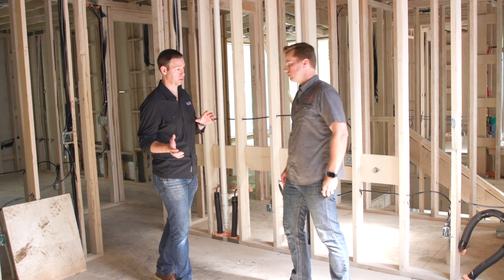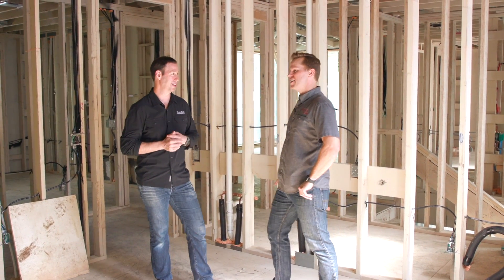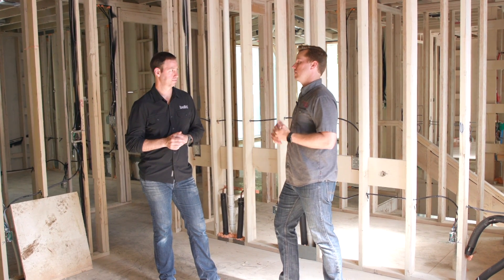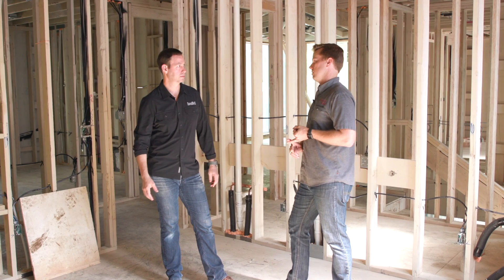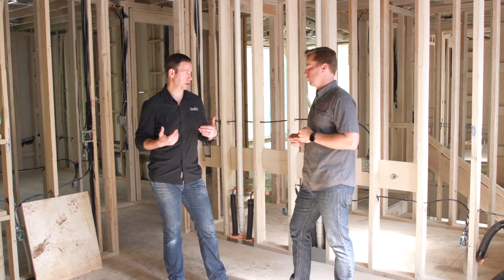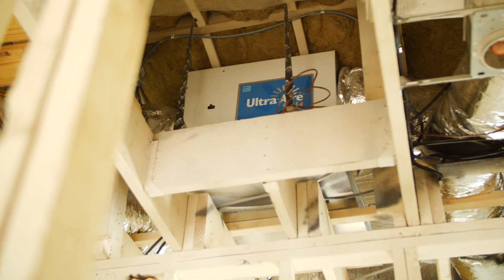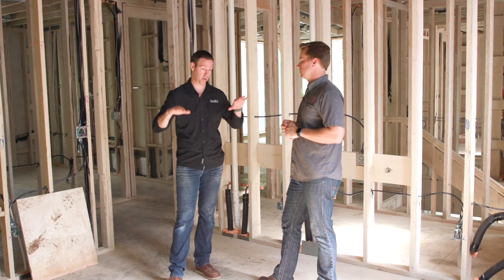Any last comments on indoor air quality or tips for someone doing this? Would you do some of these methods again? Not on every build — this is my first home to go this extreme. You want to get your homes tight so you're not bringing in outdoor dust, pollen, or humidity; control and ventilate on your terms. Once you've got that nailed, make sure you have a good filter in the HVAC. In this one we upgraded to a carbon-impregnated media filter. And there's a fresh air system — an Ultra-Aire ventilating dehumidifier right above us, a 98H that brings in fresh air on a timer, drops out the pollen with a big filter, and drops the humidity so we can keep humidity low.